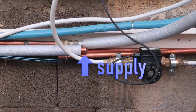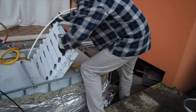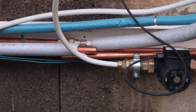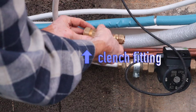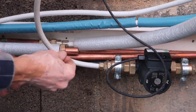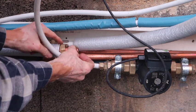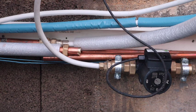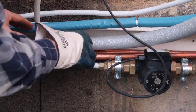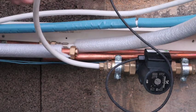So this is the end of the pipe where I want to give the water. This end returns the water that is coming from the energized radiator to pick up heat or cold in the summer. I do this connection with the clench fitting for copper pipes. So we are going to connect this piece with this piece. Then this cone goes with the narrow side into this nut. If I give too much force, I will cut my fingers on the end of this copper pipe. In this way I can do it and the nut will tighten around the tube.